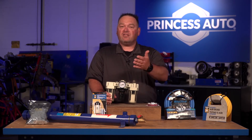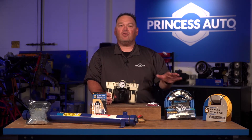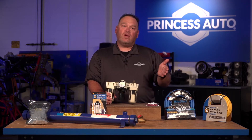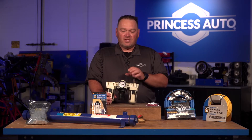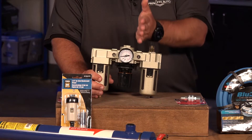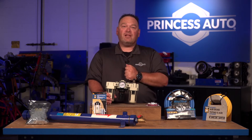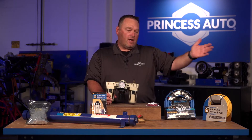Personally, in my shop I just drop a little oil into the quick coupler and lubricate my tools that way. You don't need to lubricate your hose and fittings — they don't need it. So if you have a lubricator running and decide you want to get into painting, everything from there on has oil in it. You'd actually have to disconnect everything, add new line, and start again. The other option — if these were individual units — is to put a quick coupler T between your regulator and your lubricator to create what's called a dry line.